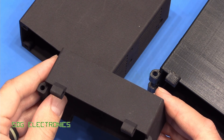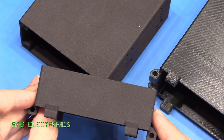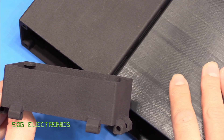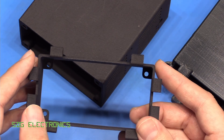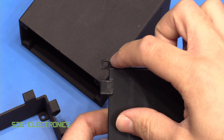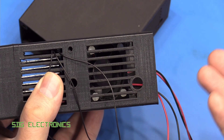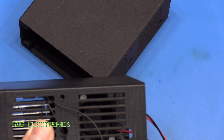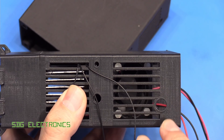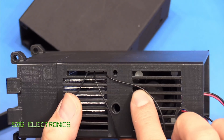These were made from nylon HPPA12. The surface finish, without any additional extras, is very clean compared to the ones I printed at home. One thing to note is that all of the circular holes are absolutely perfect. On the part I made, I ended up having to drill these out to get them perfectly circular — for example, on the DC jack you can see it's slightly oval rather than round. That's one of the advantages of having things professionally made: they deal with all the machine setup. Some of the finishes look pretty good.